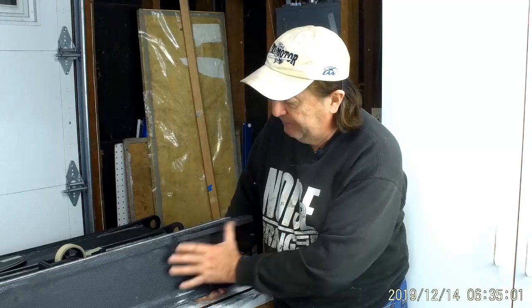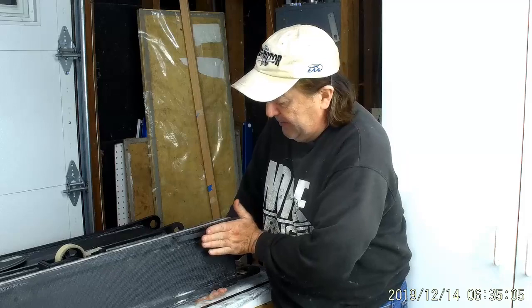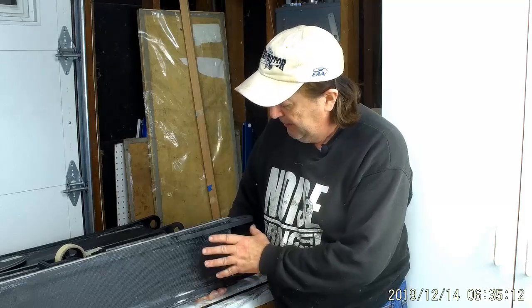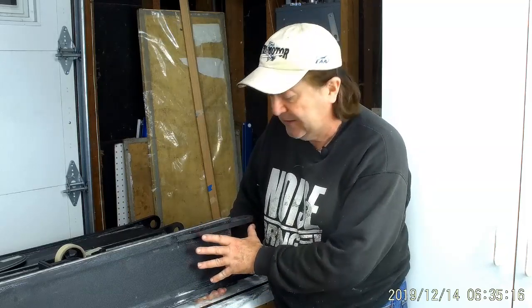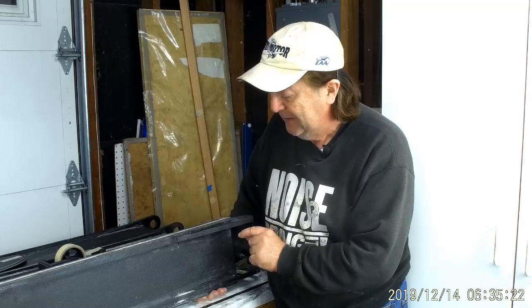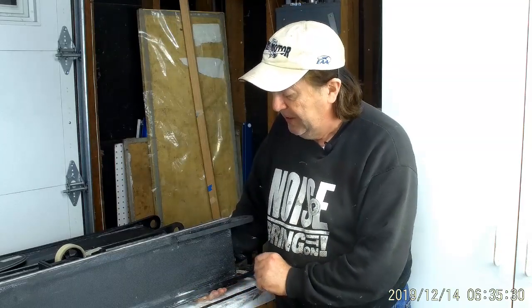Trying to make this fitting longer, this shape fitting out of a half-inch thick plate, and making this taper very, very shallow as it goes out here, it'd be very hard to build accurately. There's a manageable length for working with this stuff, so that's why this fitting's the length that it is. Plus, this length of fitting happens to come out of standard size plate. So to buy the next size plate stock up, very expensive, and you end up wasting material. So it just really wasn't an answer.